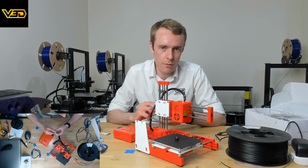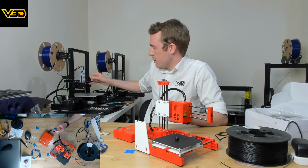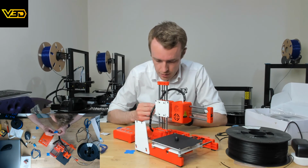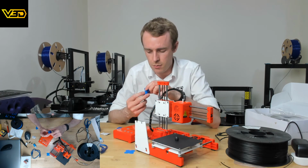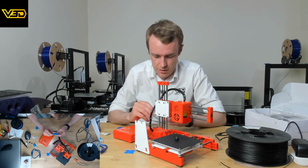the mass flow rate of plastic through the hot end is going to really limit the overall speed, whereas on the Ender 3 at least you have a proper hot end, cold end, heater cartridge style hot end. This is going to have very little thermal capacity and it's probably going to struggle, and, I mean, if you get a jam, you will really be in a jam.